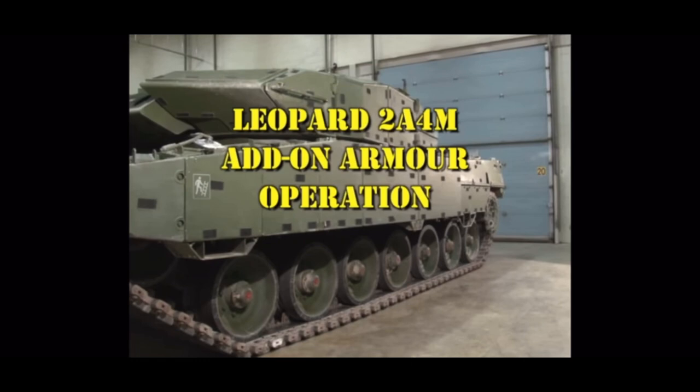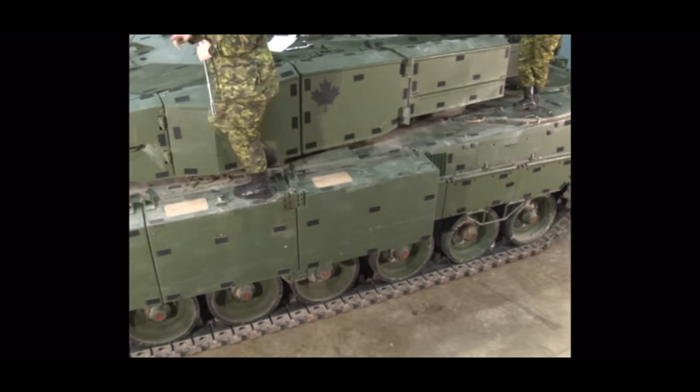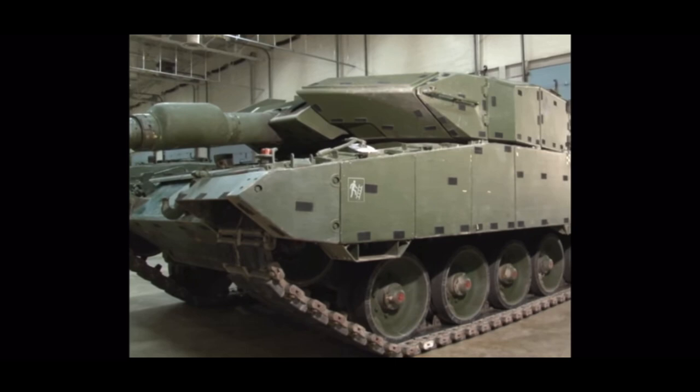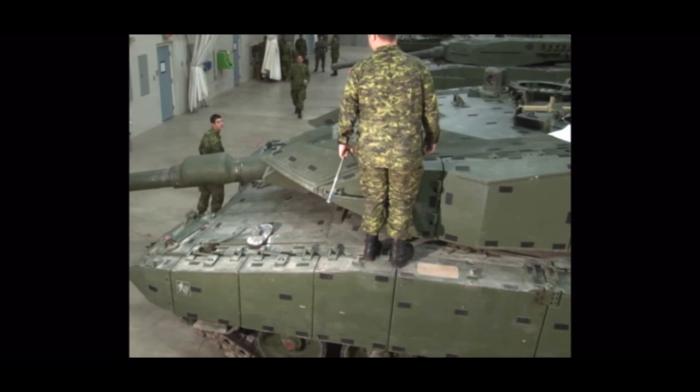The Leopard 2A4M main battle tank is fitted with a modular add-on armor system. It is important to understand how to move the armor to facilitate tasks such as refueling, accessing and removing the back deck, and maintaining the MBGDs and CBRN system. Opening the front turret side armor is required for refueling. The tools needed are a 19 millimeter socket, an extension, and a ratchet. If movement of the tank is required, it is important to remember to close the armor and not replace the large retaining bolts with the holding open pins. This procedure is the same for either the left or right access refueling points.